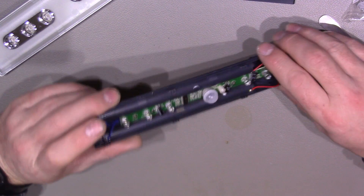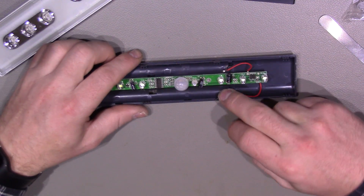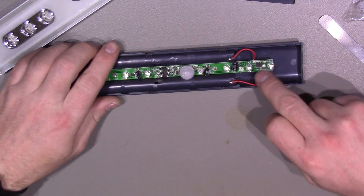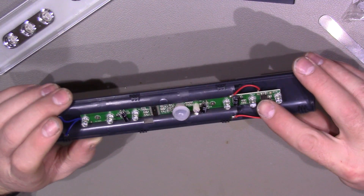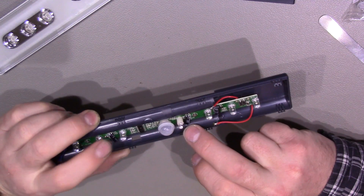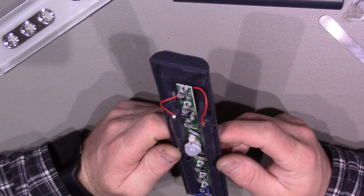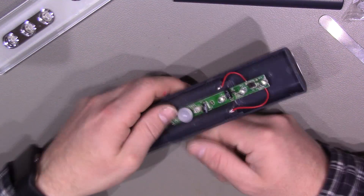From the batteries, the ground is basically just coupled together and then we've got our live connections coming in from each of the battery slots. That's why it obviously runs on three - you've got them joining in at different positions on the board. We have got a couple of diodes over here and a few capacitors - three capacitors on there, which is interesting. And then the chip, which I imagined would be the BIS0001.